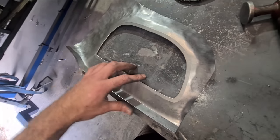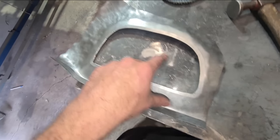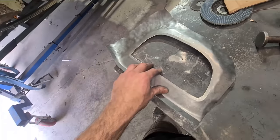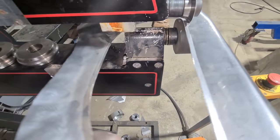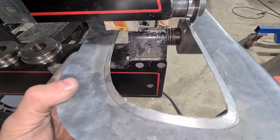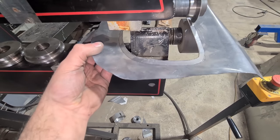Back to the bench just to trim the perimeter out for my flange. The reason I don't trim that out first is because then when you're trying to hit this area it's not strong and it'll just buckle in — just gives you a massive headache. It's best to leave that area there for strength so you can roughly shape the panel in where you want, otherwise you're just in for a world of pain. I've been there before trying to do this area first and it becomes a massive nightmare. Then it's just multiple laps with the tipping die to gradually bend it over more and more.